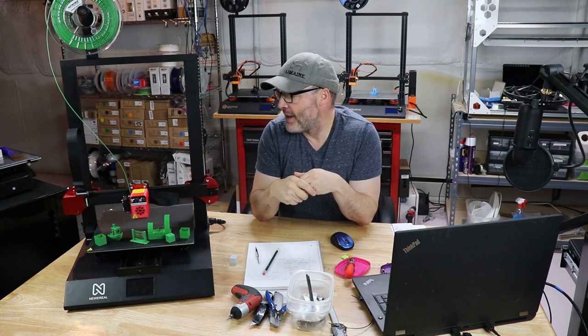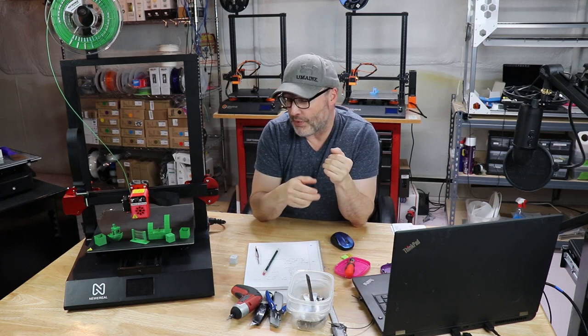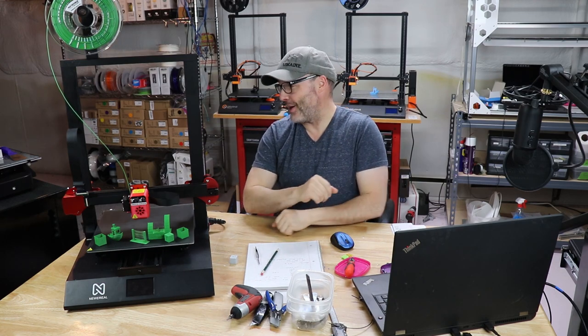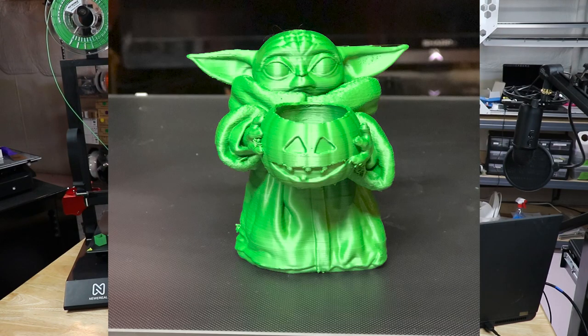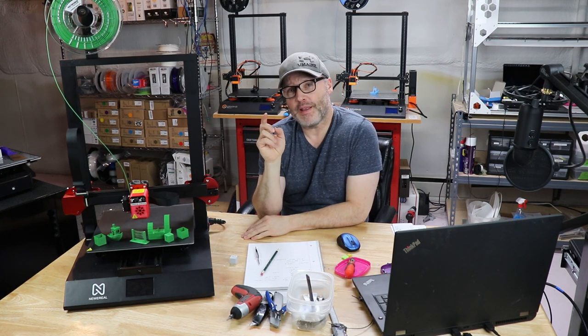I can see from my retraction tests and mini cow test that I still need to work on my retraction settings — I'm still dialing in my Simplify 3D profile. They didn't offer much slicer guidance; they always seem to recommend an old version of Cura. But my benchy came out very well — that was literally the third print off this printer. I did a calibration cube, checked my extrusion multiplier, and the prints have been coming out very good. Around Halloween I tried a Baby Yoda holding a pumpkin — a complex print with a lot of supports — and it did a great job. I was totally blown away.